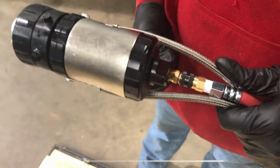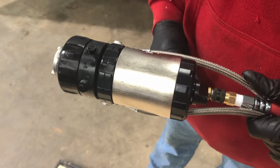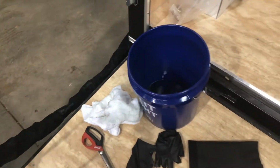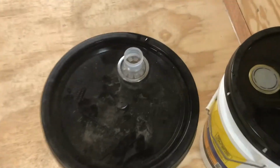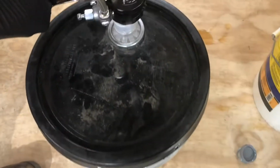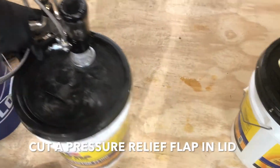As soon as you release that safety, this gun's live. You point it and squeeze that trigger. Whatever you spray, you own it. You're going to have foam on it. So right now, we're just going to do a little quick purge into a bucket. Try not to make a whole mess here. It's usually easier in one of these buckets because you can shoot right into the nozzle. Hopefully not make a mess. All right, hold up. Yep. All right, so we're ready to spray.